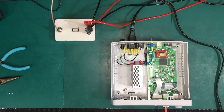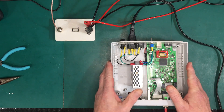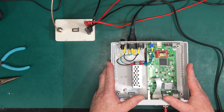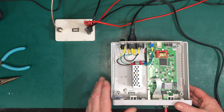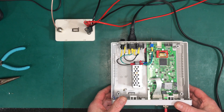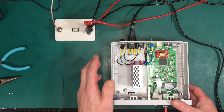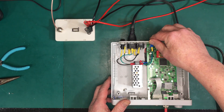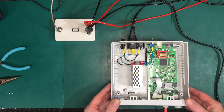It's a little disappointing, but it is better — we have made an improvement rather than making it worse. We've improved the time base on this thing so it's more accurate, and we can have a little more confidence in what the display is telling us. We've definitely improved the power supply too — it no longer has all that leakage: 49 volts of AC leakage. We can now switch it between ground and floating, and we've reduced the noise significantly. All in all, I think it's been a worthwhile project.